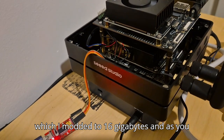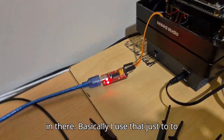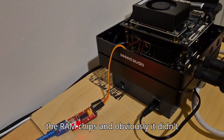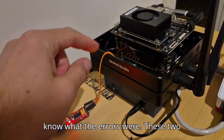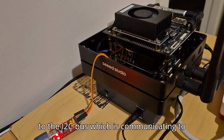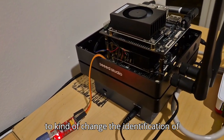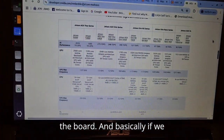You can see the UART connected in there — I used that to communicate to the board and do a lot of debugging when I first replaced the RAM chips. Obviously it did boot eventually. These two wires coming out here connect to the I2C bus, which communicates to the EEPROM, and I needed that to change the identification of the board.